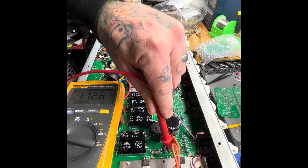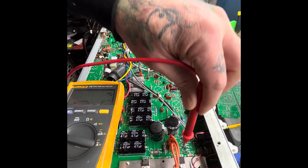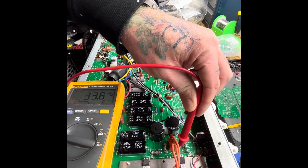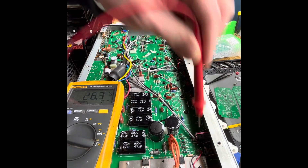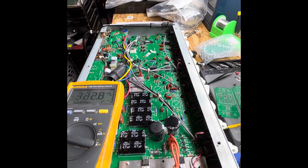This fuse over here reads 17.2 volts. Go to the other side of the fuse and we're at 29 millivolts. So now that tells me this fuse is open — current is unable to flow through it. So there's a diagnosis.